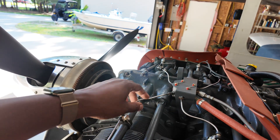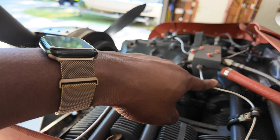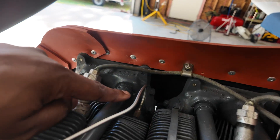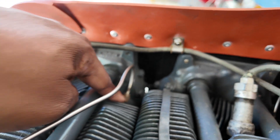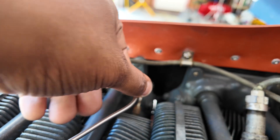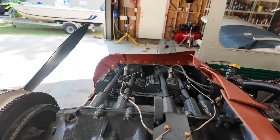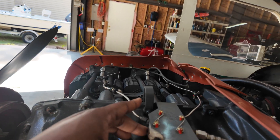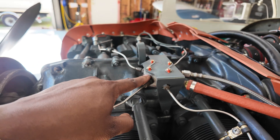This is fuel injected, which is the 'I' in IO-360. You'll see some fuel injection lines here which lead to a fuel injection nozzle down here. If someone says they've got GAMI injectors, what you do is switch out these nozzles — unscrew them, put some new calibrated nozzles from GAMI in. This one does not have GAMI injectors. There's a distribution spider right here — fuel is being distributed to all the different cylinders via this unit right here.